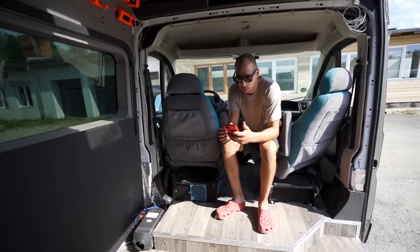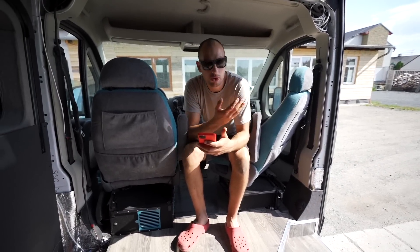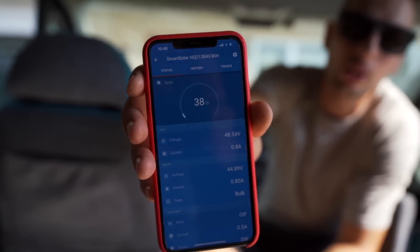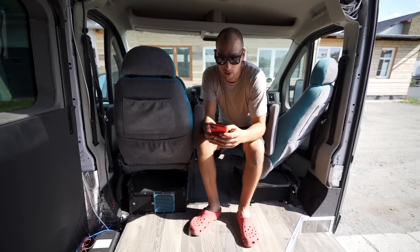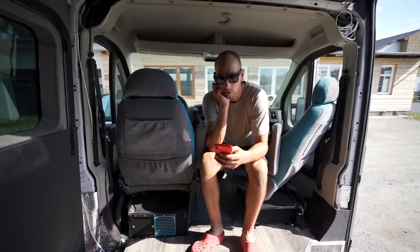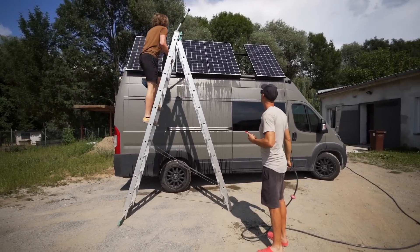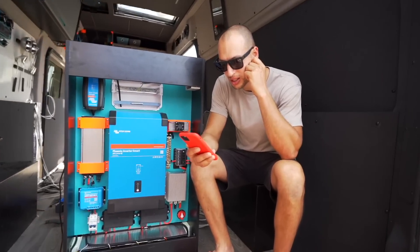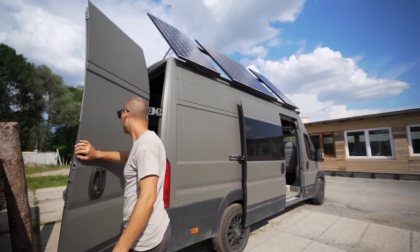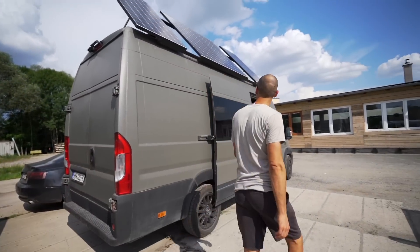I'm pretty disappointed. It's summertime, bright daylight, not shaded — we just cleaned the solar panels and I'm getting not even 40 watts out of a theoretical 1000. These solars are tilted now; that's been a lot of work dealing with this power system. The voltage of the solars needs to be five volts higher than the battery voltage — I didn't know it needed to be higher. At least the solar tilts still work — that hasn't failed yet.